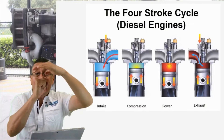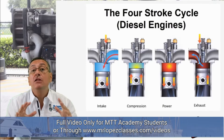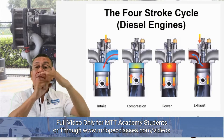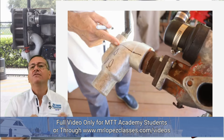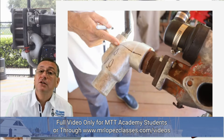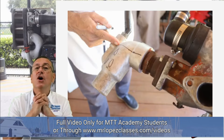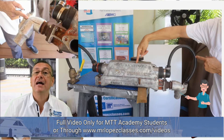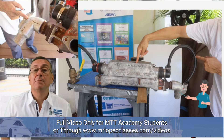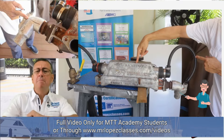Suppose that during the intake the intake valve is open, but for some reason the exhaust valve opens a little. The exhaust valve during intake should be completely closed. This is not good, especially in marine engines. The problem is water entering the combustion chamber. When salt water enters, the thermal expansion of aluminum is twice that of iron, so the piston expands and blocks the engine immediately — this is catastrophic.